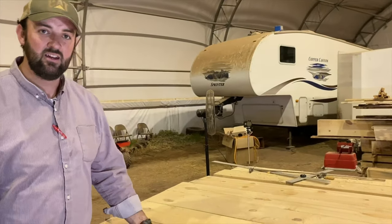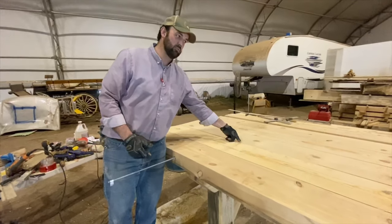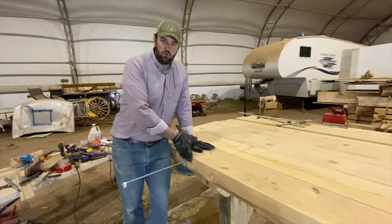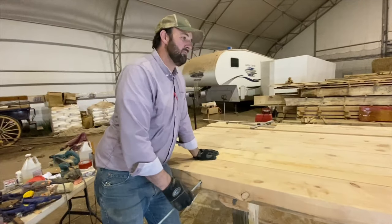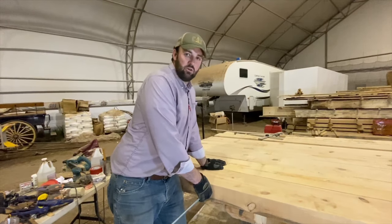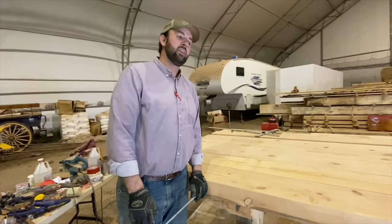But we've got to take these over and cut them down to length. This is 50 inches. Well, it's a little bit proud of 50 inches because we're not getting the gaps really super tight even when we push them hard. So we better leave room for 50 1/4 inches. I want this to be shorter than 50 inches by probably an inch. So 49, maybe 49 1/4. Let's do 49 1/4 on these. Well, we can do it barely under 50, because we won't see it.